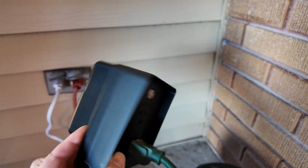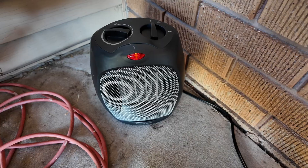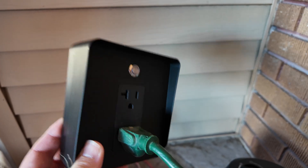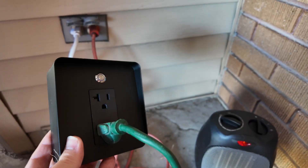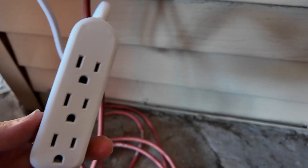This is what they call their smart NEC breaker. It can detect when you put a heavy load — like a space heater — on the same circuit and will automatically turn your solar power off. So you get protection on the circuit without derating your solar. It's a simple device: it just plugs in here and then your solar — my green cable — plugs into the front of it.